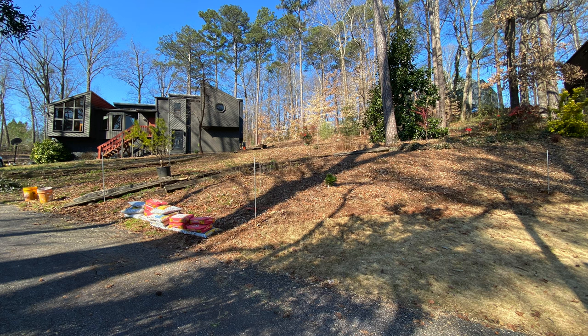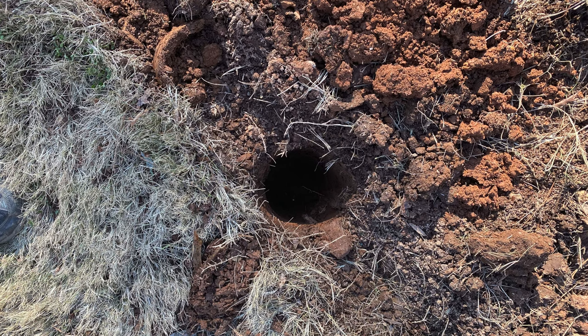We're also going with a more modern look, which you'll see in a little bit. We have done this before in a previous house so we thought we'd give it a try. I'm using a post hole digger to dig these holes out. We have a lot of roots, so anything like spinning just isn't the best idea — like an auger. If you hit a root with an auger, you're in real trouble. You can also see a trench that's been dug already next to that hole with a skinny trench digger, just a shovel that's a skinny shovel.